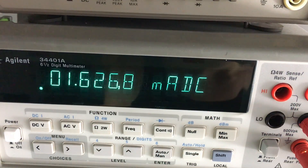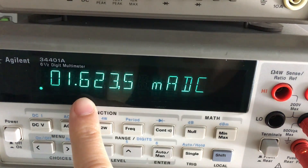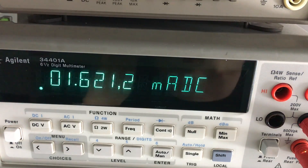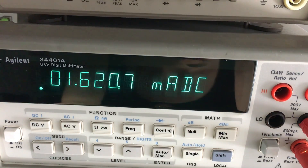Before the teardown I want to measure the current consumption. Dave tested his meter and got about 1.7mA; testing mine I'm seeing a similar value that varies by range — between 1.6 and 1.7mA. Taking 1.7mA and approximating a AAA battery at roughly 1600–1700mAh at a very low discharge current, we can get between 800 and 1000 hours of usage out of this meter.